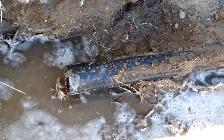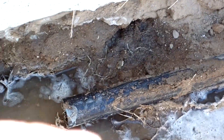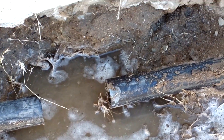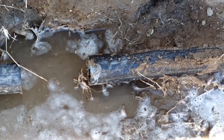What we're going to do today is, in theory, dig more around this pipe, mostly back this way, up the pipe. Avoid this here — yep, there it is — gas line. I know it's a gas line because the gas line is also underneath this pipe here. Luckily there are metal parts there that go to your house. The part that goes to your house from the company is usually plastic, so it doesn't deteriorate as easily. But since there are no bubbles coming from that water, I know I haven't cracked the metal pipe yet.